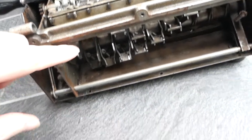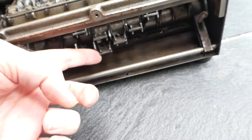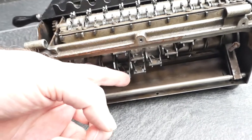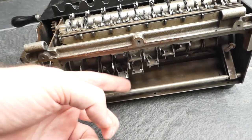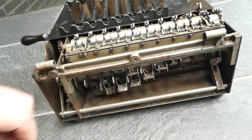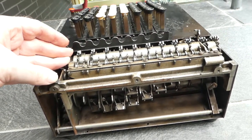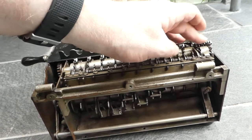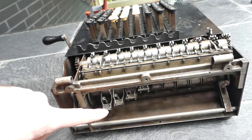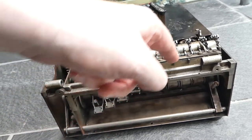Here you have the carry drum, and it has these horizontal pins that slide sideways. When one of these carry switches has been tripped, it pushes these pins sideways when they pass, and then the other end pulls along the next intermediate wheel. The carries have to be performed from right to left — from the low end of the register to the most significant digit of the register.